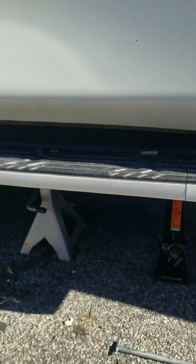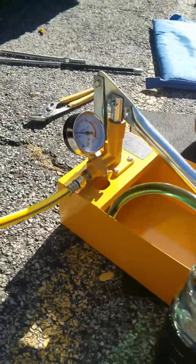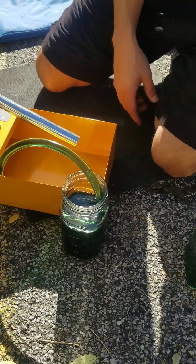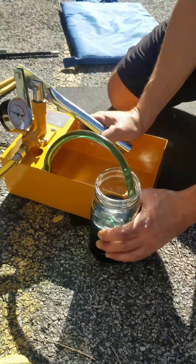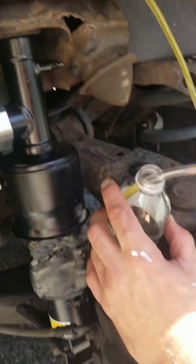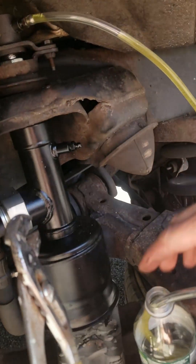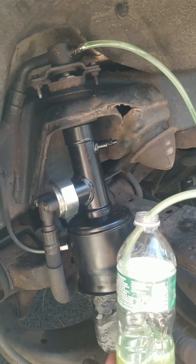So we connected the hose to that accumulator. Now we add the fluid and start pumping. We open the valves - open the ball valves - and pump pressure inside. You don't have to pump too much, just about half of the required pressure. Then you start to bleed. You have to start on the top, unscrew this part, make a tube. You see the air is coming out - a lot of air inside.